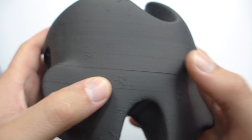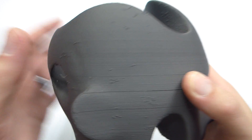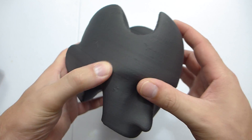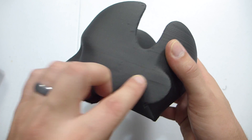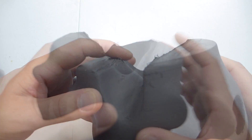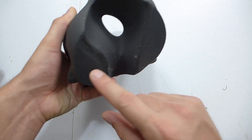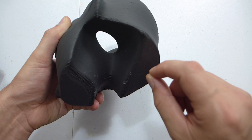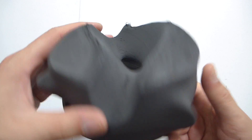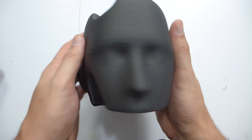More so are these cracks. This was printed at 205 degrees, and I actually think that was a little too low for this print. Just because of the sheer mass of it, it cracked on me — very odd for PLA, maybe because of the carbon fiber. A few areas were a little over-extruded, so there were definitely some irregularities going on. I didn't use support and it did okay, though these are some pretty steep overhangs. I actually had to sink this down into the Z-plate to get a larger surface area to start from, since the contact points were absolutely tiny. A smidgen of support might have done better there, but I just wanted to give this a shot.